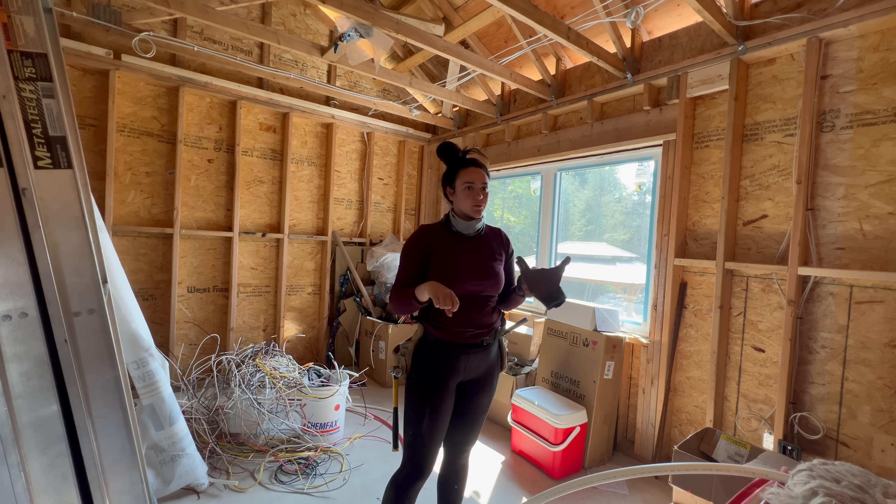I have to pull a bit of slack to get this wire over to where it needs to be. I also just realized I need another one here for where the shelf is going. The next wire goes from here across to the next floating shelf — we're doing upper cabinetry with floating shelves, only 11 or 13 inches deep, perfect for dishes or plants. We want under-cabinet lighting on these tiny floating shelves to give more light to the sink, since I don't have anything above the sink other than sconces and under-cabinet lighting on either side. There are also pot lights above, and this is the last of my 18-4 low-voltage trace wire.